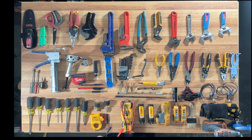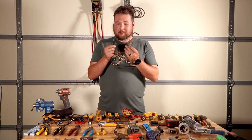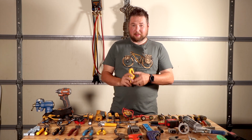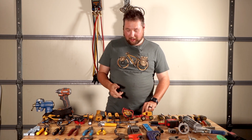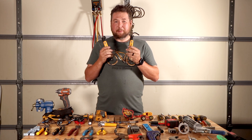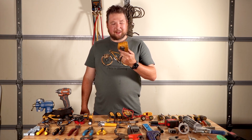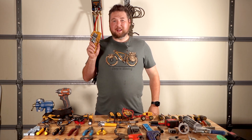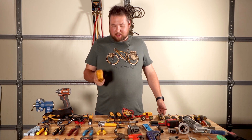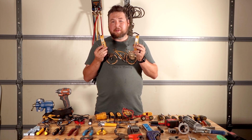You're definitely going to need an electrical meter. It's nice to have alligator clamps you can hook up to wiring, and you're definitely going to want micro leads — a lot of the new equipment has small connections that regular leads won't fit. You're going to want a set of manometers; it doesn't have to be wireless ones, but you'll definitely need one. This infrared thermometer is one of those things you don't really need, but I highly suggest it — you can measure grills to see if it's cooling or check motor temperatures. You'll also want a set of probe thermometers.